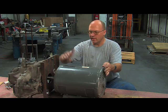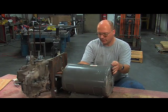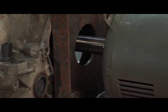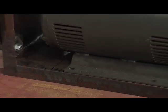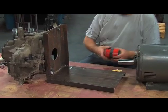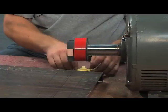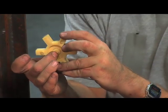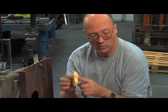What we're going to do now is try to fit the motor and line it up with the transmission. The first thing I'm going to do is place the motor on here with the motor shaft touching the shaft of the transmission, then mark where the front motor holes land on the plate. That will give me the closest I can fit the motor and the transmission without having to cut anything. Once I put the couplers on — the transmission coupler and the motor coupler — I would put the spider in between. But I would have to drill out the center core so that the two shafts could come up to each other. That center core is about three-eighths of an inch thick, so that's the closest I could do this without having to cut the shafts.